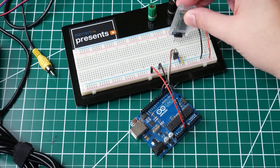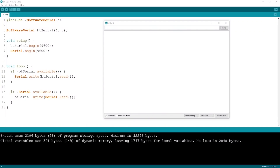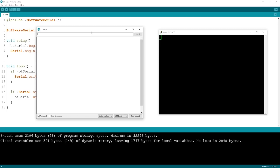This is an HC06 Bluetooth module, and we're going to configure it to receive data from the Raspberry Pi, which has Bluetooth built in. The module uses serial communication, so after wiring it up we'll create an Arduino sketch using software serial — this offers port flexibility and allows us to continue using the serial monitor to issue commands. The HC06 supports AT commands, and we can use them to set the password and device name. For testing, I'll pair it in Windows where the module appears as a serial port, and use the free tool PuTTY to send data back and forth. Pairing with the Raspberry Pi is more complicated, but you only need to do it once — after that, the code opens the connection by itself.